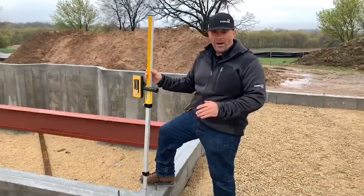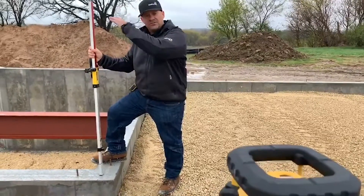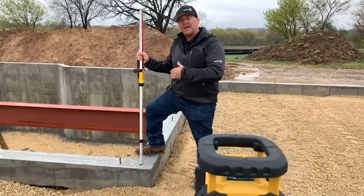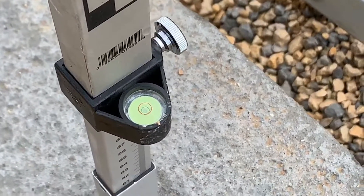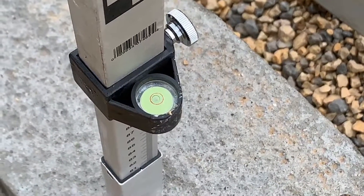What's unique about the rod as well, as we're shooting grades — in a two-man operation with a guy on the other end of a transit, if he's leaning in or out with his stick, he's actually giving you a false reading. The little bubble vial on the end of our grade rod lets you know that you're actually holding it in the level or plumb position.